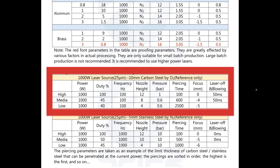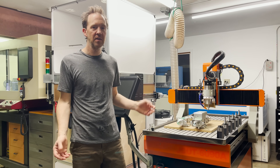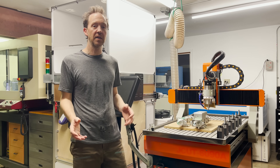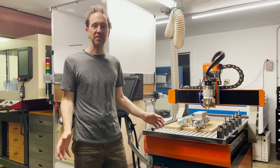This is where having an autofocus head really has its advantages. With my manual focus head, I'd have to pause the program, take out my wrench, and adjust the focus at each of these stages to do this cut. Whereas with an autofocus head, you would just set it up in the software and it would run it. In summary, if you're going to be cutting thin material, the manual focus head works fine — it's simple enough to use. If you're going to be cutting thicker material where you'll need a piercing operation, get yourself an autofocus head and save yourself a lot of headache.